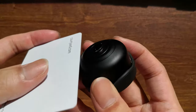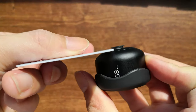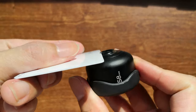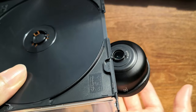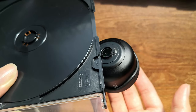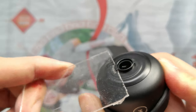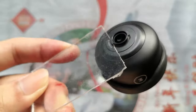We now have a plan, but we still don't have the material to build on. A hotel key card feels like a logical choice for an adapter plate — rigid yet easy to handle. Unfortunately, it was too thin for the mounting ears to grip securely. The thickness of a slim CD case seemed perfect, but it was too brittle and broke halfway through the job. Eventually, I settled on a card extracted from a TPU iPhone case — rigid, durable, yet easy to form.